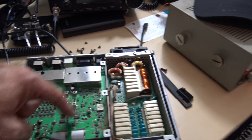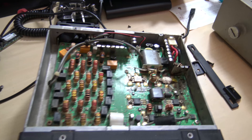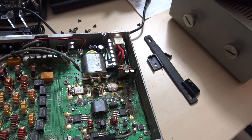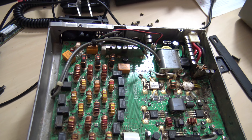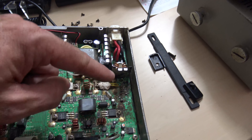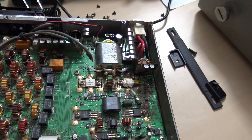I'm not going to take this board out or take the tuner out, but I am going to clean this. I recommend using rubbing alcohol, brushing it, then compressed air. The rubbing alcohol will dry out. If you use water — no good. I do have some mass airflow sensor cleaner that would really work on that. As long as it's completely dry, I can clean it with anything — just nothing left over when I turn it on. So the mass airflow sensor cleaner or alcohol will clean this. We may have a shot at getting this working.